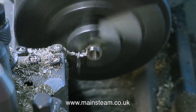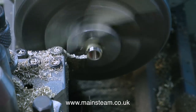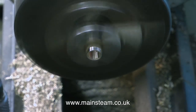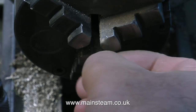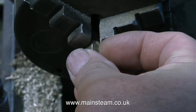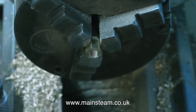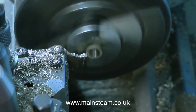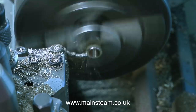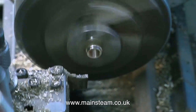This two imperial sizes down for the tapping size drill works with ME threads and BA sizes, but it does not work with every type of thread. I assume that if you're watching this you have a computer, so all you need to do is go on to Google and type in the search box 'tapping sizes for ME threads.' I've turned the part round in the chuck now and I'm just machining the other end to make it look a little bit fancier. I didn't bother changing the tool in the tool post — I'm just using the parting tool.